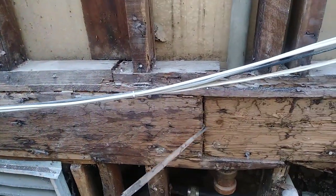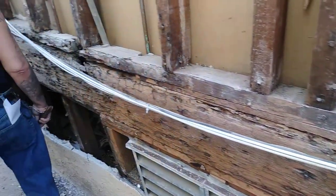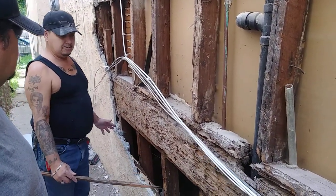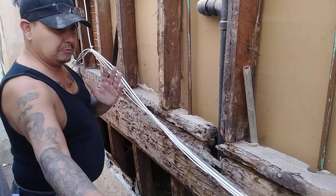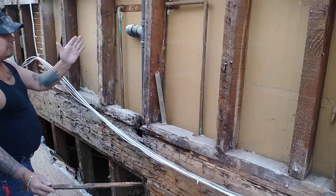See the gap you have here? So what I'm going to do is jack it up in sections, rebuild that section, put it down, and rebuild the next section — put it down and rebuild that section back even. Then I'm going to reinforce all the 2x4s.